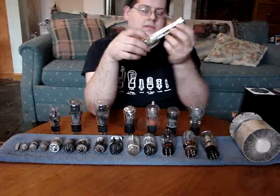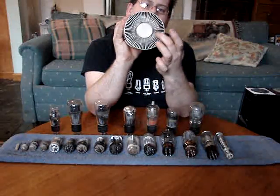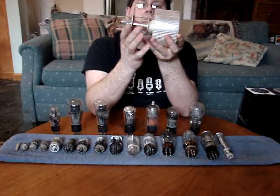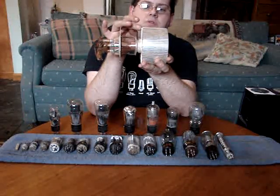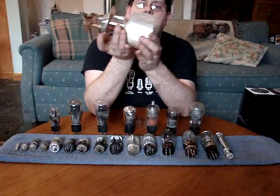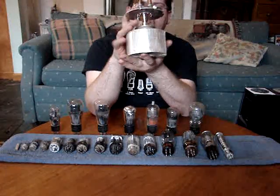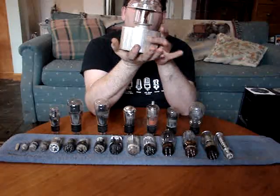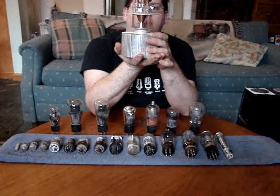This is brand new also. And this is a heavy duty industrial type tube — it is air cooled, notice the fins. This one is no good anymore. Most of the time these big industrial tubes they will rebuild: they separate the tube, put new parts inside, reuse the cooling fins, and rebuild them. This one is no longer supported — they don't rebuild this one anymore, so that's why I got it. A tube like this would run about $1,500 to $2,000 new; rebuilt, you could probably get one for about $600 to $800. They're very expensive. The larger ones, the 25,000 watt tubes and up, cost significantly more. This one I believe is about 4,000 watts — it was used in an RF generator in industry.